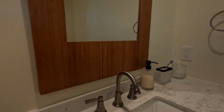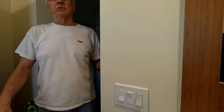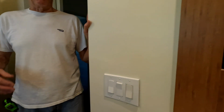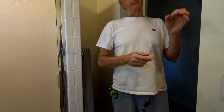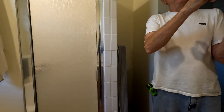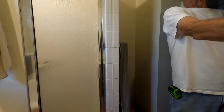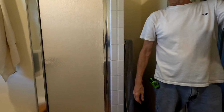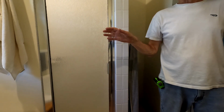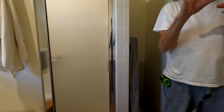Hey. How's it going? Good, how are you? I'm doing great. So, Chris said he did not mention to you about the washing machine. What's the problem with it? So there's not a problem anymore. What happened initially, why we even found this, I think it blew the water intake valves. When it had an issue, because she was trying to run the hot water to the washer, and they smell like a burning smell. And I'm thinking some of it was at least that rubber around the tank. But I think it also blew out the intake control valves on the washing machine because it wouldn't take any water at all. So I replaced those, and now we're getting water. But I have not tried to get any hot water, just water. So okay, the washer's fine.